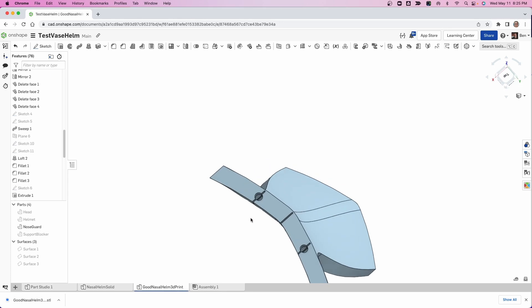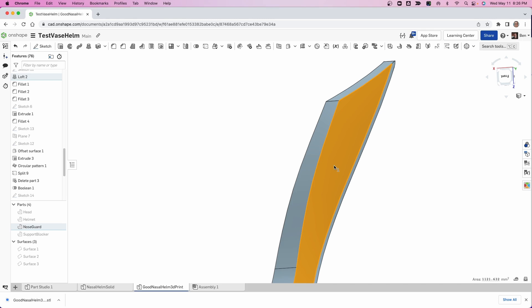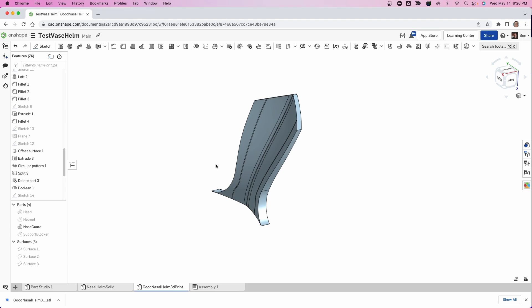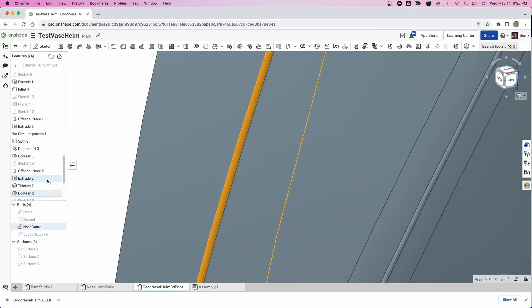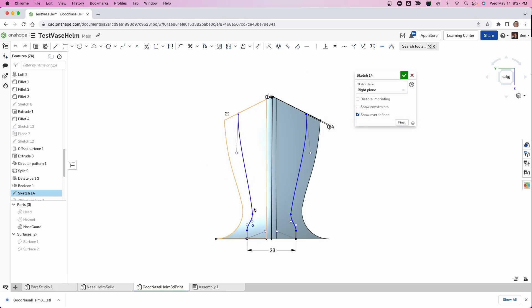You're probably wondering what the nose guard looks like — the modeling is similar but different. One trick I learned: I put in alignment pins that are the diameter of your filament. You just cut off little chunks of filament and stuff them in the holes, and it lines everything up so when you glue it all together it works incredibly well. We take this face, offset it to the inside 0.4 millimeters, then I created a couple of sketches for where the ribs belong — making sure that distance is 0.4 millimeters, that magic distance. I roughed out where the ribs should be: one down the center and a couple off to the side for strength. Probably massive overkill, but from there I extrude it out, make it thicker, and cut those pieces.